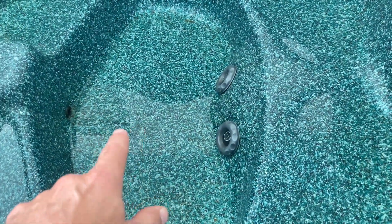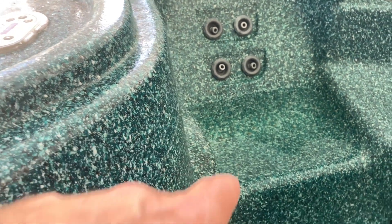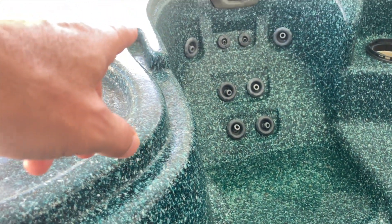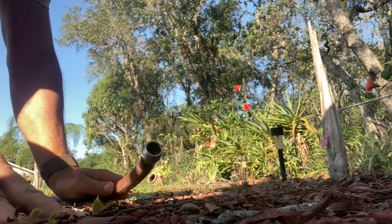This area is probably a little too shallow - I'm just gonna push that into the center. I've got a shop vac and I'll just suck the rest of it out. If you've ever done any siphon work you'll understand that's gonna be a challenge. There's about a two-foot drop right there, so I've got to put the hose in, bring it over the two-foot mark, then go to the other end of the hose and start sucking - draw with the power of my lungs up that two-foot mark. Once the water gets over the edge, gravity will do the rest.